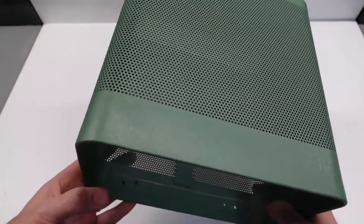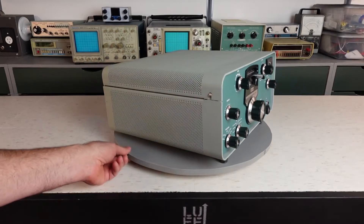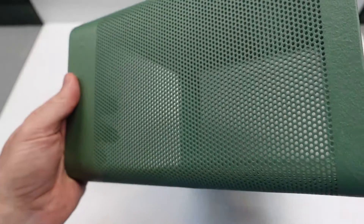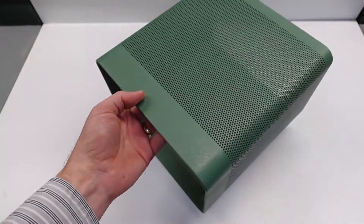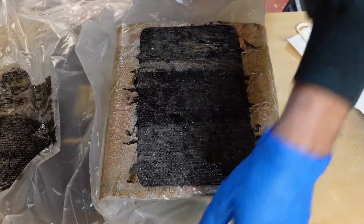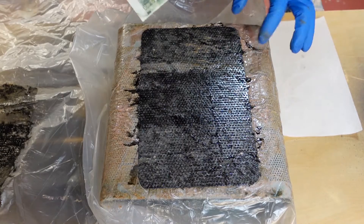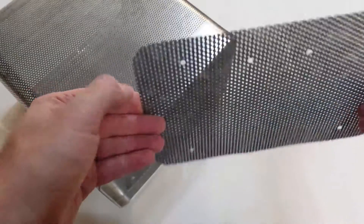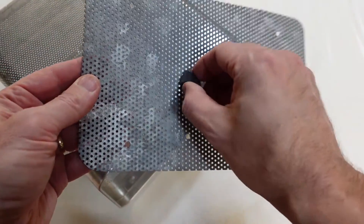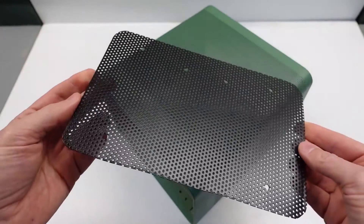Here's what the SB600 looks like after all the painting steps. This is definitely not a match to the original color — the factory Heathkit green on the SB600 was much lighter, almost a mint green. I chose to paint it the same color as the HW101 because this is its companion; they'll be sitting right next to each other in my shack, so it's good to have them match. The speaker grill had an odd black stripe down the center that I couldn't verify as factory original, so the stripper took it right off. I followed the same paint steps minus the texture and used a satin sheen black paint. I even wire brushed the heads of the four speaker mounting screws and gave them a blast of the same primer and black paint.